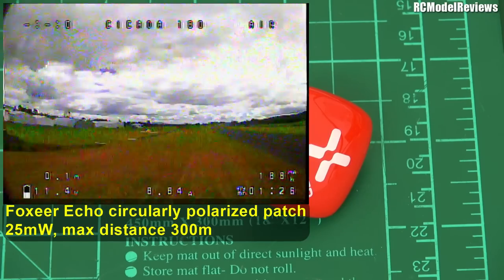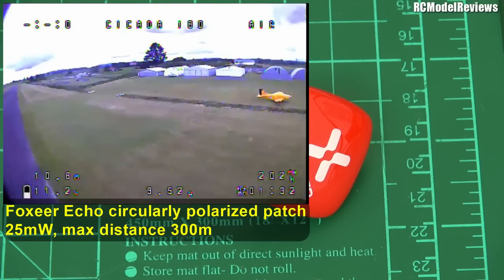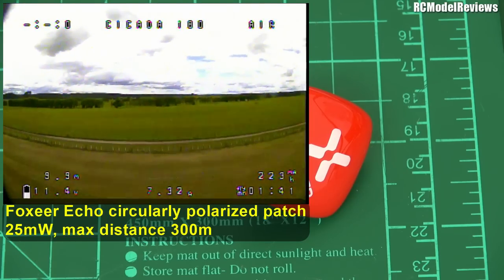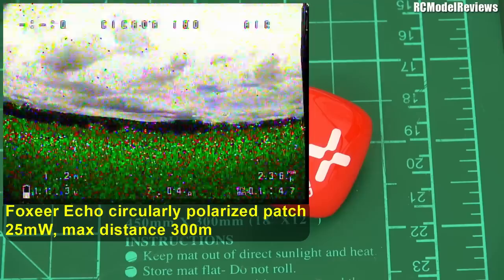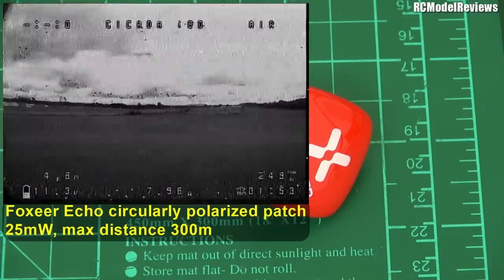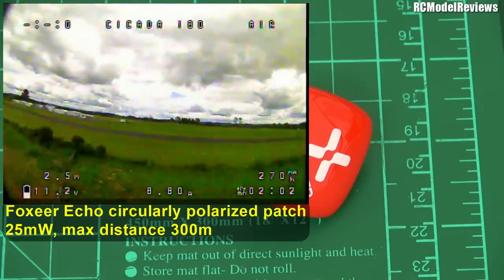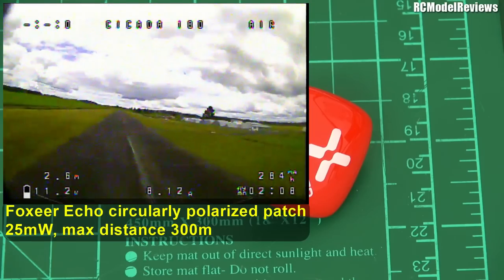I'm going to fly past the DVR. We're going into the back of it now, and we can see the signal starting to drop off — dropping off, getting pretty bad. So it definitely is gain out one side, no gain out the other. In fact it's worse than the omnidirectional back this way. Then I thought I'd fly out over the paddock at right angles to the DVR to check what the side-lobe performance is like. That's quite important because you're not going to always be flying in front and may not turn your head properly. Flying out to the side we're getting a lot of multi-pathing and Fresnel effects — starting to break up. But we have got a surprising amount of good quality image out the side. Now we're getting into a null point. It definitely has some side lobes and a main lobe, and if you get between them you can lose signal, but that's true of any directional antenna. Back on the beam — she's all good. Probably 150 meters away, and it definitely is an antenna with gain.